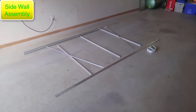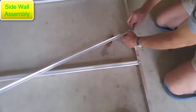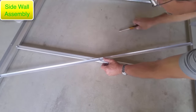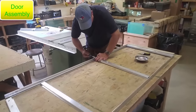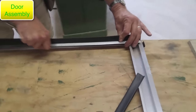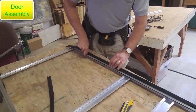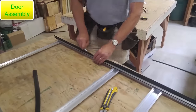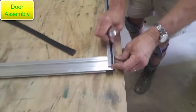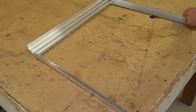Step three is building the side walls. Lay everything out and get it together — it goes quite quickly. We're working on the floor of a garage. The door should be done in your shop too, as there are lots of small pieces. This is a detail of the draft guard that goes on either side of the door. The Halls manual shows you slipping it in from the end of the door pieces, but it's actually better to lay it in place and use something soft — here I'm using a spoon — to coax the rubber draft guard into place.